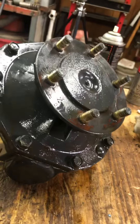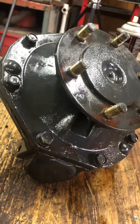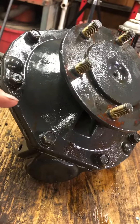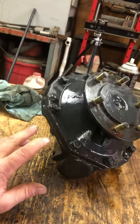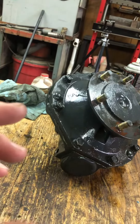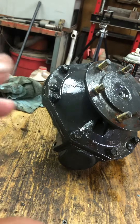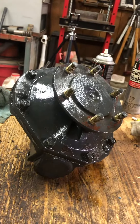Those little banana clips aren't held in by anything but the viscosity of the oil. There's a bevel gear in here, and on the bottom side of that bevel gear there's a recess that fits over top of those two banana clips — they're held in by that recess. Alright, I'm going to go ahead and take this apart now.